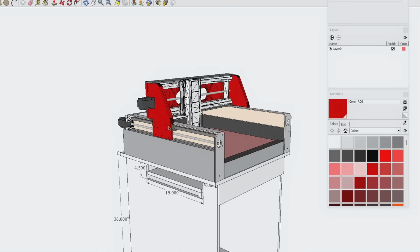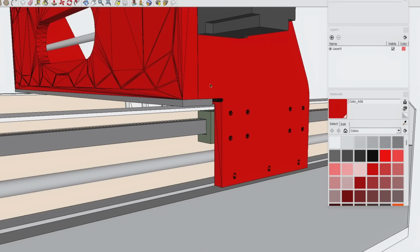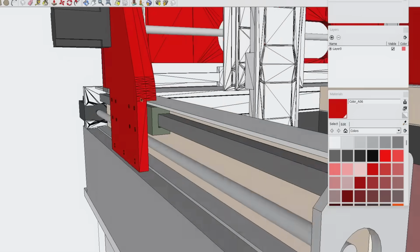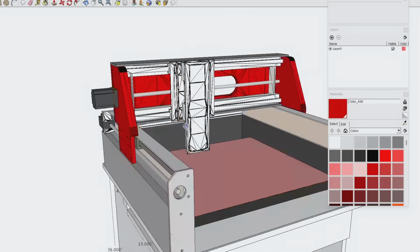And that's not all, and that's where the drawing comes in. I'll briefly show it here so you can see what I'm talking about. So with that space cut down to a bare minimum, there's very little chance that it will move side to side. It also reduces the effective height of the gantry sides, taking that out of the equation. As in, it doesn't need to be made from 1/2 inch thick aluminum or steel. The plywood that I used once again for the gantry, because you'll see that coming up, more spongy plywood. Where's that piece of plywood? Here it is right here. More of the spongy plywood will be used for the gantry.